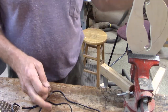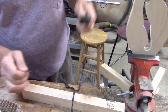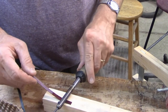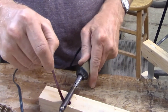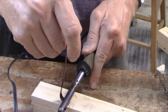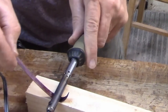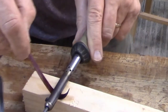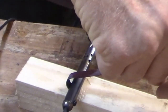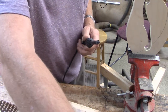The way I bend them is with a soldering iron and the water that's on the wood to begin with. I just rock the soldering iron back and forth and apply careful pressure, because even though it's only 30 thousandths of an inch thick, this wood especially is prone to chipping and shattering. It doesn't take the bending as nicely as I would like. I dip it back in the water.